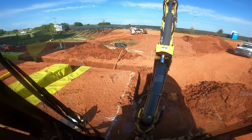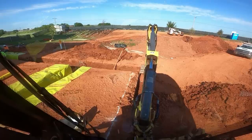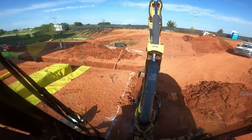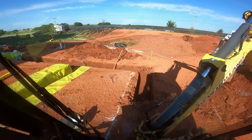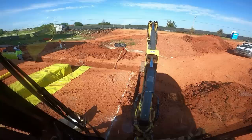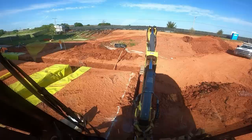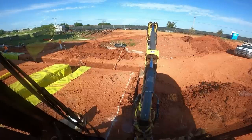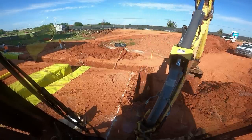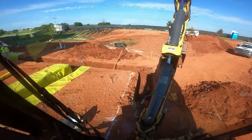This is a little school add-on building — they're adding on to a building here. They've got piers, so we're digging around rebar. Just kind of a typical commercial job. They built the pad up with select fill, overexcavated first, then came in and built this up. They did a pretty good job compacting it — it's pretty tight, pretty good stuff.